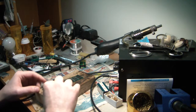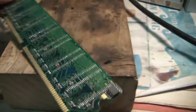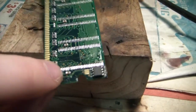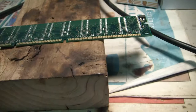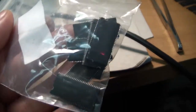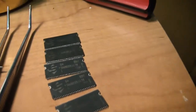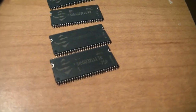I'm going to pause for a minute and go ahead and remove the rest of the chips. The memory chips are removed — you can see the PCB is empty. I've put back the capacitor that I accidentally removed. I found the tweezers that I like to use. Here are the old chips — I removed them and put them in a baggie, and I'll have to label them so I know what kind of chips they are in case they're useful in some other project. Here are the eight chips from the 512 megabyte SODIMM module.